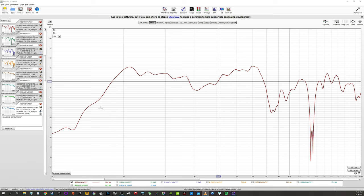This was hardly a scientific test, so let's look at some measurements in Room EQ Wizard to see if there are any changes to frequency response before talking about the impacts to sound quality. Our first measurement is of the SVS PB2000 Pro without the isolation feet attached. This subwoofer is placed in the front right corner of the room and this measurement was taken at the main listening position. If we turn on the measurement with the isolation feet attached — the green line — we can see that nothing really changed. Any variation in response, which is incredibly minor, I'll chalk up to just being a margin of error.